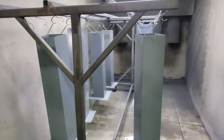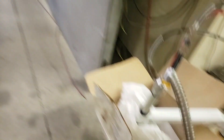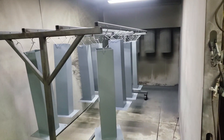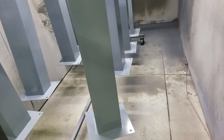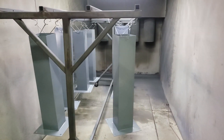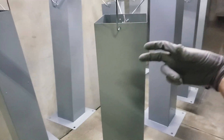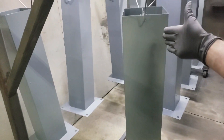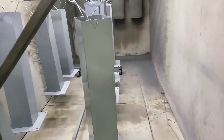These are the parts now out of the oven and into the booth. We're going to go ahead and top coat them with our sky white from APC also. This probably isn't the best white we use — you'll see a lot of it up in the air and on the floor. Their primer actually sticks really well; we just sprayed it and it had just a light dusting on the floor. The white kind of goes up in the air more and doesn't track to the part as well. Also notice my gun and how far I'm away from the part. When you're doing recoats, if you get too close you're going to start seeing back ionization. You want to make sure you're 8 to 10 inches away from the part — just let the paint go to the part and it will do what it needs to do.